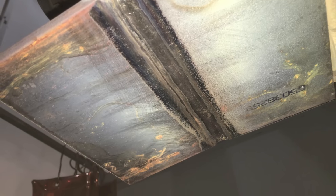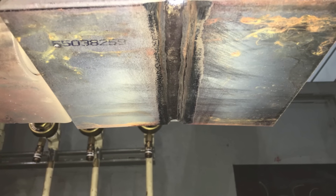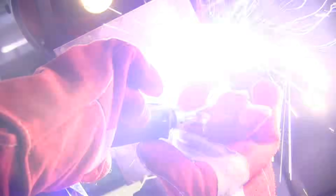The edge was melted just a little bit so the edges aren't perfectly straight, but they're close enough. You can see on the left-hand side how the puddle is consuming the straight edge there — those edges aren't quite perfect, but they're close enough to follow for a good cover pass. Now we're going to do a two-bead cover pass. Follow the WPS and make sure to let it cool off enough to be within the interpass temperature requirements.